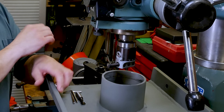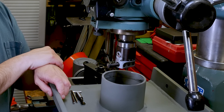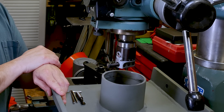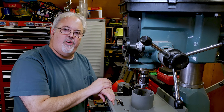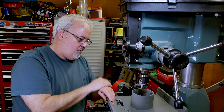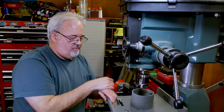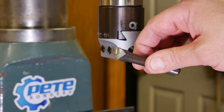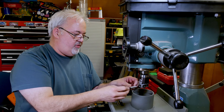It's very odd that they would sell this. Granted, this is not an expensive product, but if they're going to sell it saying it's supposed to be able to do something, well, it ought to be able to do it. This part of the project has now taken way longer than I ever expected. This was supposed to be quick. I almost feel like I need to relieve the backside of this. Well, what the heck, I'll do it. Alright, I've gone ahead and I've ground a little backside radius on there. Hopefully that'll give me a little bit more clearance going down through the hole.